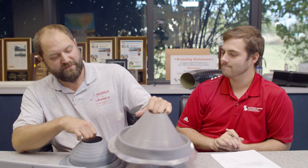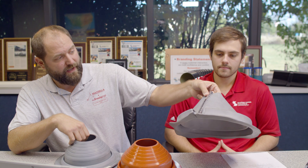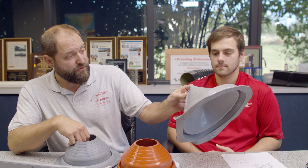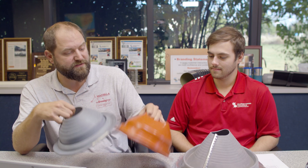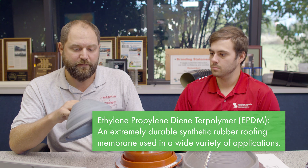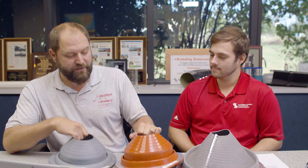There are a number of types of pipe boots and a number of different ways to flash a pipe. Today we wanted to discuss how we're using EPDM and silicone-type pipe boots. What we have here is a retrofit EPDM pipe boot — that's for situations where you can't fit it over the pipe and need to get around it. For more typical installations, we have your standard deck-type pipe boot: one is EPDM, and one is a high-temp version rated up to 390–392 degrees for higher roofline temperatures. For standard installations, you'd typically use a gray or colored EPDM-type pipe boot.